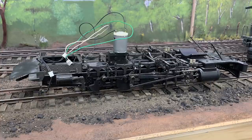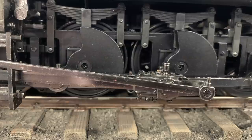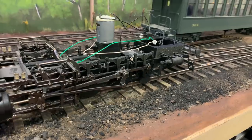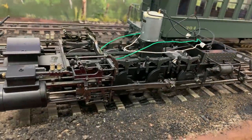I can't test this because it's jamming up because the valves are all out of time. The other Connie is just sitting right there — it's timed correctly, so all I have to do is match what's going on with this one. With the valve timing all the way to the back, the counterweights are at about a 45-degree angle facing the back of the locomotive. Set it like that on both sides — the valves are now timed correctly. So all you have to do is match everything to that picture if you need to re-time your Connie.